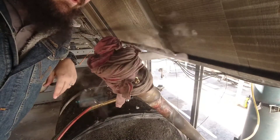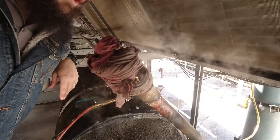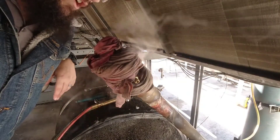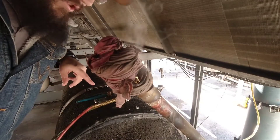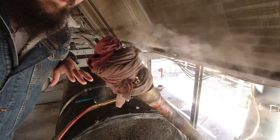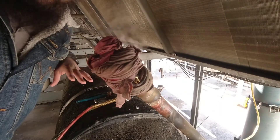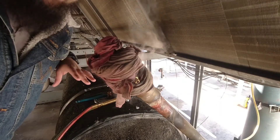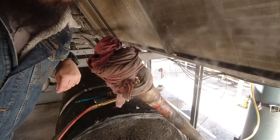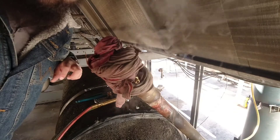Okay, pretty sure we got it. We're going to let that sit for a few minutes, let everything cool down, then repressurize the system and see if we hold. The critical thing when you're using higher concentration brazing sticks is you have got to control your heat — that's going to make or break your joint. You cannot get it too hot; it will not bond to the joint at all. There's a really tight little window where you get the perfect weld.